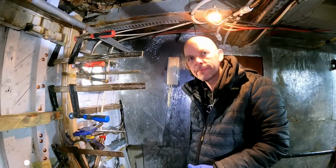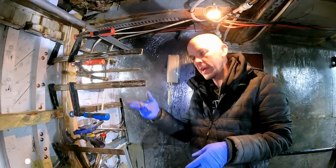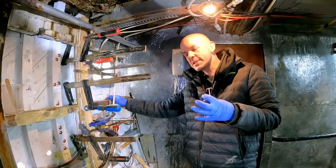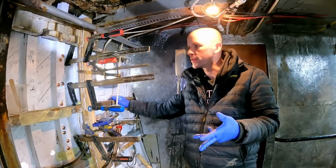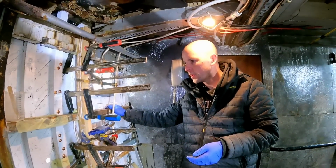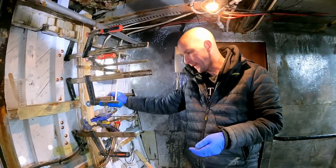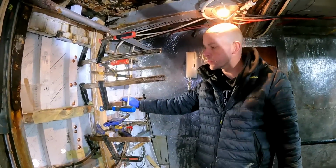And then how much glue did you use? A lot, okay, because I'm going to start doing little tests like this. Is it worth steaming or gluing? Well, I used 4 pumps of epoxy. The amount of energy it takes to steam, and the time. I suppose this takes time, doesn't it? So the time is not an issue, it's about the energy. We've had that done for less than what it takes to steam. I know it costs more in epoxy, but if you think of fuel for the generator, for the steamer. Yeah, and noise and that. It's a lot of tests to see. It should work out really well, should be super strong, shouldn't it?